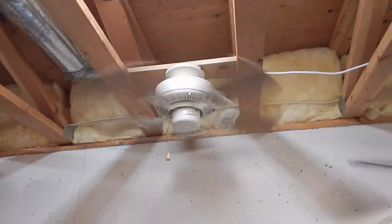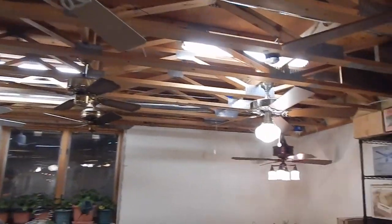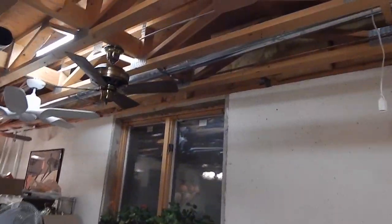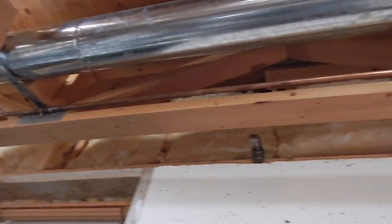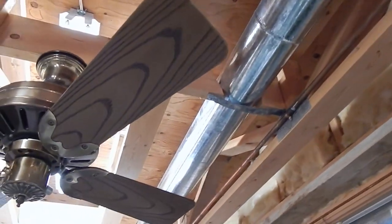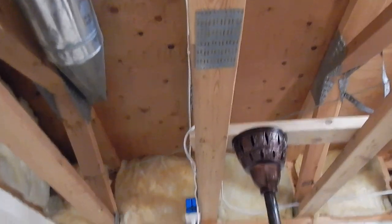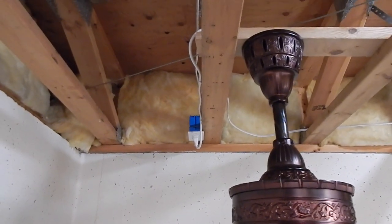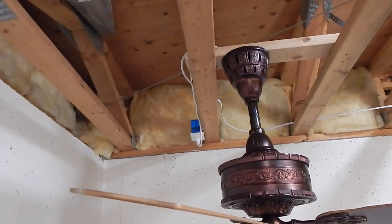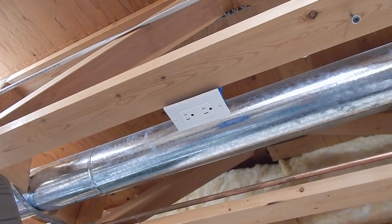Here it is in place. I meant to record a little bit more of this process but it was such a quick little move that there wasn't really much to show. I do really like how it fits in here. So now down at this end I mainly just have to get power in for the Emerson. I was just noticing I have a pipe that kind of ends up in the way of where I wanted to put my boxes, so I'm going to have to figure out placement. I will likely end up going right next to the fan somewhere and if I do want to continue any more down I'll just have to keep them going down this same truss. I have wire coming over to where I'm going to put my box, and while I really dislike going back and redoing things I did move this box over onto the same truss just for the sake of continuity. Now I just need to get my box in with the outlet and then we'll be ready to assemble the fan. Outlet is in - I'm going to get to putting the fan together.